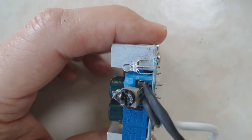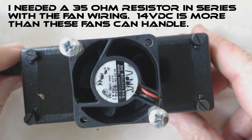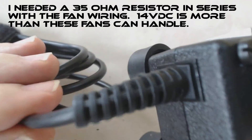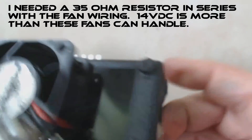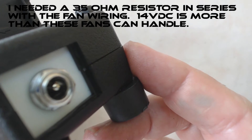The LED glows green when the unit is powered and on standby, and red under load. Here's the complete unit — this case is my old HP power supply case. It made it really easy to use the cord and the strain relief, and I just adapted it with a 5.5mm by 2.1mm jack for the input.